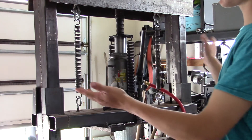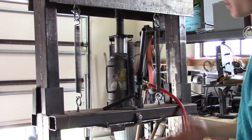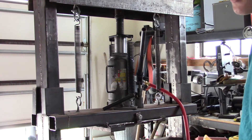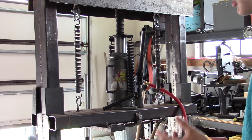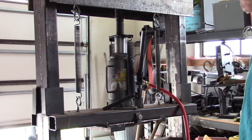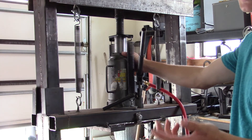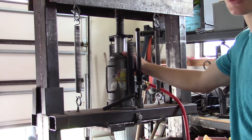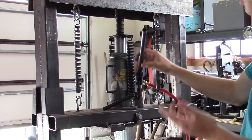I'm going to stress safety. This is extremely dangerous. If you have 20 tons of pressure inside a frame under that much pressure, it could potentially explode — maybe crack and bend, I don't know. I overbuilt this intentionally because I never wanted to risk it blowing up in my face. Make sure you have a strong enough welder that can get deep penetration for really solid welds, or that you bolt it together heavily. You can go to Harbor Freight and buy one of their 20-ton presses and then switch it out for an air pneumatic — this is probably one of the best ways to do it. This was fun to build, but honestly in productivity it would have been easier to just buy a press and modify it.